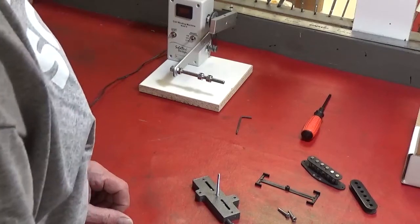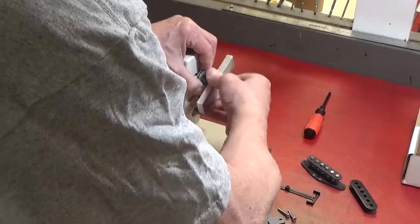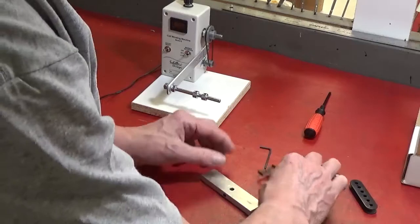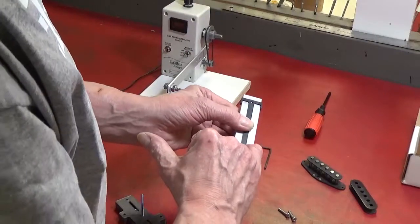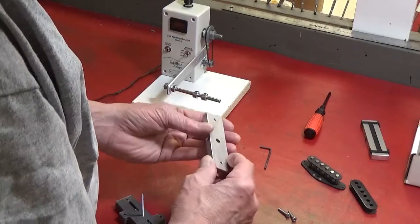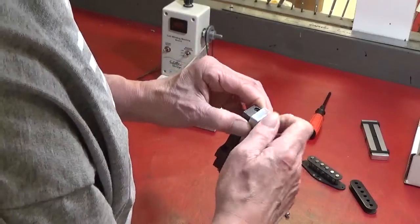Let's look at installing the bobbin holder onto our B-kit. I'm going to take the winder arm off. In order to fit this on, we need to drill two holes in the existing winder arm. We've provided this little plastic template which you can place on the winder arm — it shows where to drill two very small holes through the arm. I've already done that on this arm. The bobbin holder will be placed on the winder arm, and one of the two smaller screws will thread into the bobbin holder.